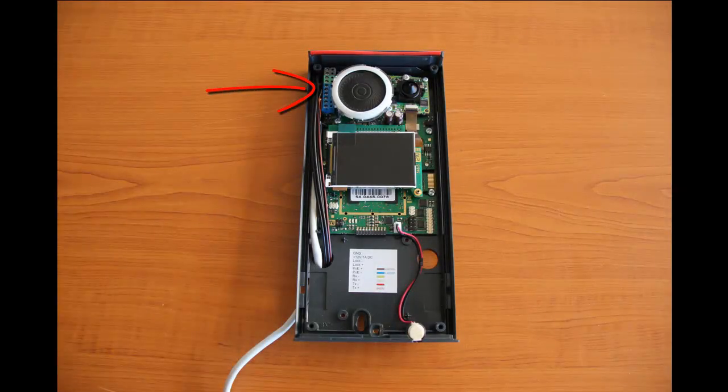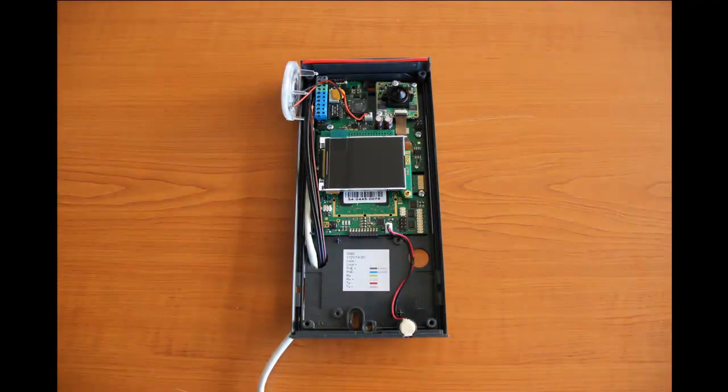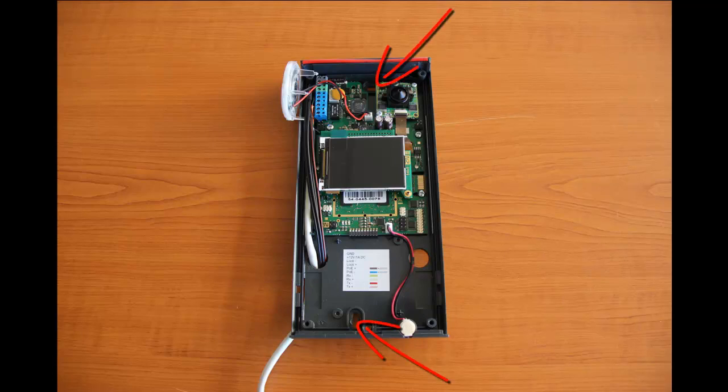Please make sure that the wires will allow the replacement of the plastic cover back on its place later on. Now is the time to attach the Helios IP Vario chassis to the wall. Please use the two holes for screws which will hold the Helios IP on a wall or in a mounting box. It's very important, especially for outdoor installation, to make sure that no water or any humidity can get into the Helios IP Vario. I do recommend sealing all the openings in the chassis.